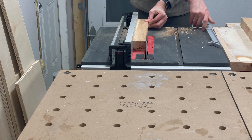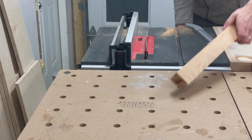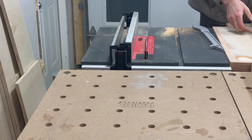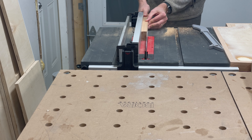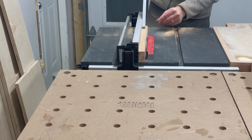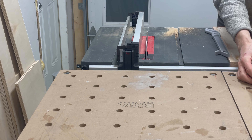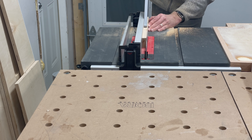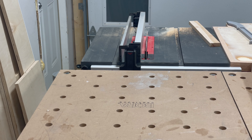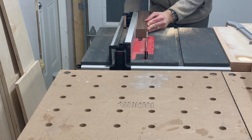The secret to this next step is to take off the least amount of material possible — I aim for around a sixteenth of an inch, roughly half the thickness of a blade kerf. Not only does this give us the tight glue lines we're looking for, but it also removes any burning from the saw. Cutting 8 quarter hardwoods, especially hard maple, is going to lead to some burning — especially on a job site saw where you don't have the power of a five horsepower cabinet saw. By removing just a very small amount, you're left with a very clean edge.